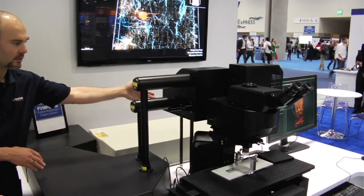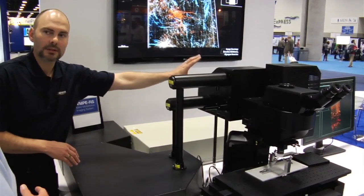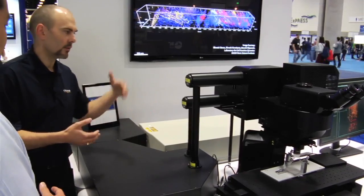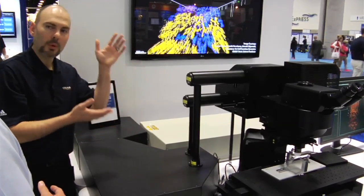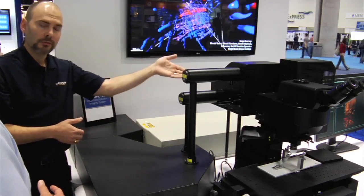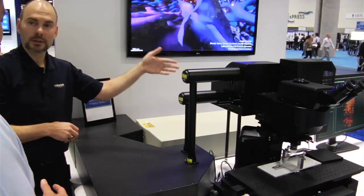As we're controlling both of these laser beams, we can introduce them either into the main scanner — which contains the high-precision galvanometer scanner and the resonant scanner — or into another optional SIM scanner. The SIM scanner is another set of galvanometer mirrors which allows you to simultaneously stimulate while you are imaging with the main laser. This is really important because if you have delay in highly precise optogenetic experiments and high-speed physiology experiments, you're going to miss some of the critical activity — particularly if you're synchronizing with electrophysiology or any other external device.